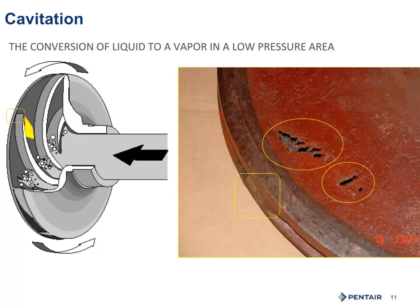So how can you tell if you are cavitating? Often you can hear it. More importantly, if you have a valve on the discharge, you can turn the valve in slowly, reducing the flow or the production, and the noise seems to go away or will get softer. Opening the valve back up again and the noise increases. In a sense, you can play with the noise.